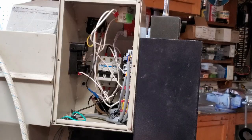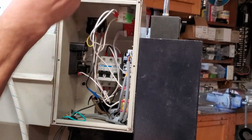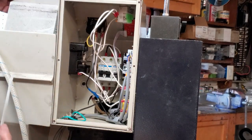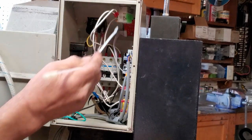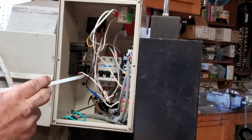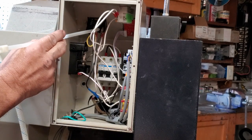As it's wired right now, the ground circuit is broken by the emergency off switch or by the door. The white wire just loops around to the ground, and this is the ground for the magnetic switch. So once you break the ground, the magnetic switch will release.